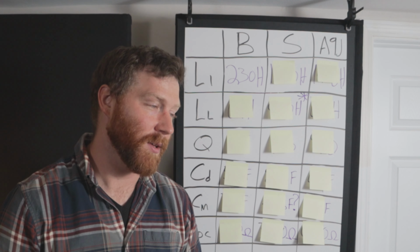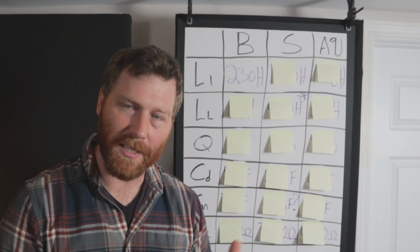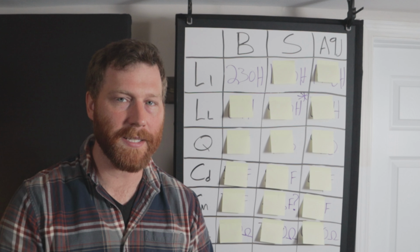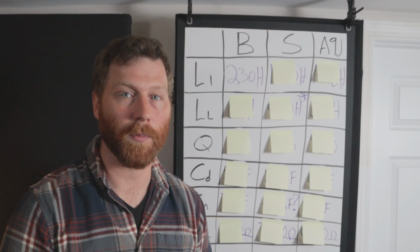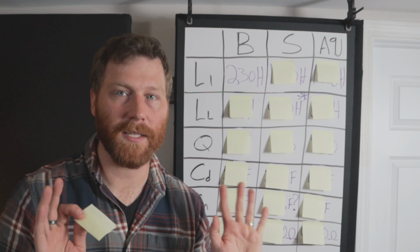And, you know, that's a total apples to oranges sort of comparison, but it just gives you a reference of the degree of high inductance that we're talking about with these transformers. It does not have the same number of winds as 100 guitar pickups. The core of the transformer has a big role to play in driving the inductance up like that. But it's an interesting reference.